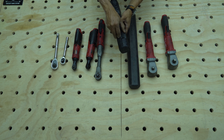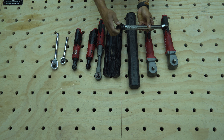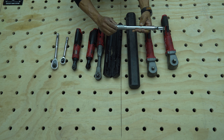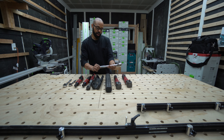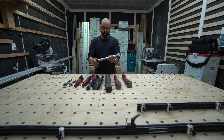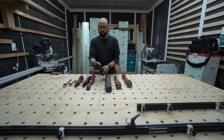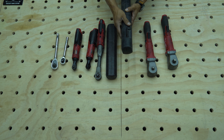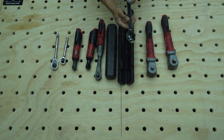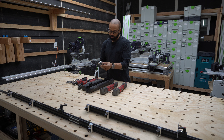Opening this one here — this is a low-tech model. It just has a screw on the end and you twist it to get to your foot pounds. So this one is in foot pounds, and on the other side you have kilograms and centimeters worth of torque strength. This one here is my quarter inch for smaller jobs, and then this other one is my half inch, which actually has Newton meters and also foot pounds as well.